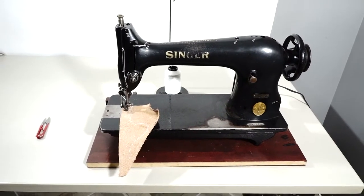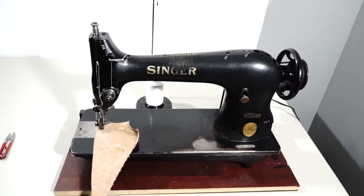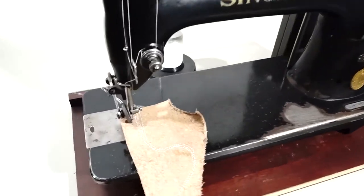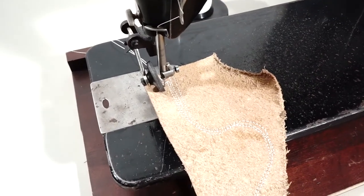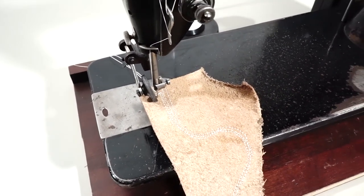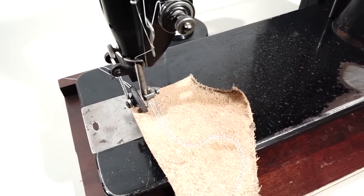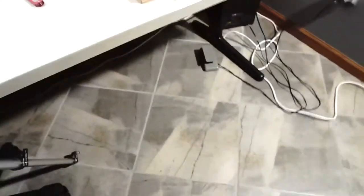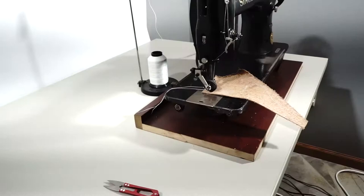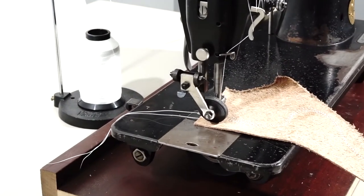This is a quick video on the Singer 315 industrial sewing machine. It's set up with a wheel instead of a foot, and was used for leather work like doing boot tops in a custom boot shop. I'll get it on the tripod and show it running. I was adjusting the check spring earlier and didn't realize the thread path wasn't even correct, but the machine still sews fine.